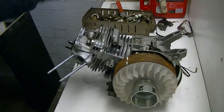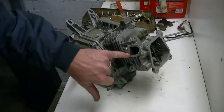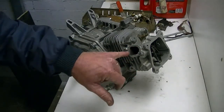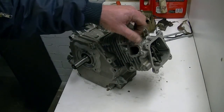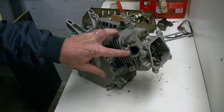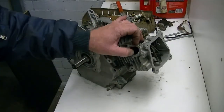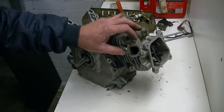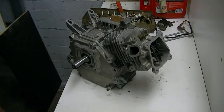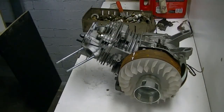I guess now it's time to continue on and make the refrigeration unit and everything for it. It's going to have a little trouble sealing the exhaust side — as you can see, it's an awfully large square hole and we don't have a lot of sealing surface area around the exhaust port. I'm thinking I may have to do some modifications here — maybe a bit of alloy welding to build that up, then cut a ring groove in there. Maybe even drill it and tap it out once we've built it up so we can use a screw-in thread. That would probably be the better way to go. But it seems to spin up quite fine — we're well on our way.